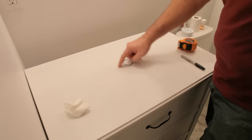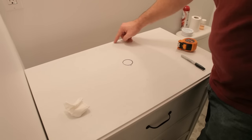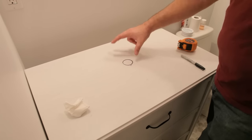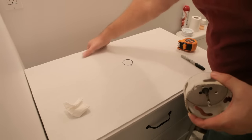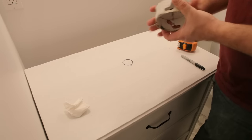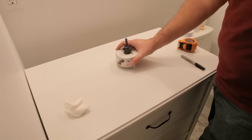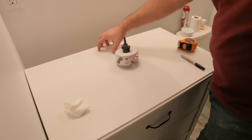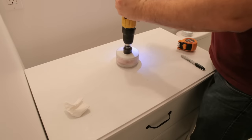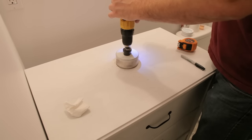The instructions call for a large rectangle hole to make sure there's space for the drain and all the tap fittings. Because I don't trust how strong this counter is — it was never designed to take the weight of a sink — I want to remove as little material as possible. So I'll start with a four-inch hole saw on the front, then drill a smaller two-inch hole in the back. Hopefully this will keep the most amount of strength possible.